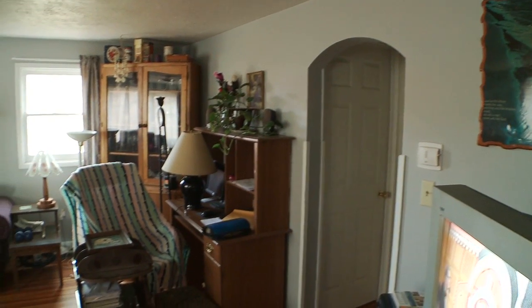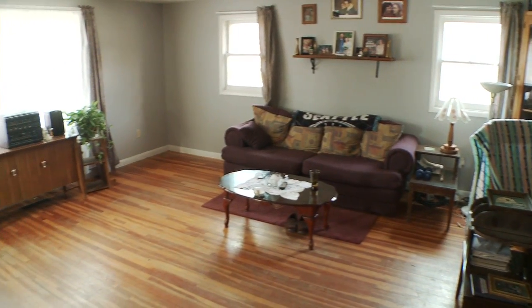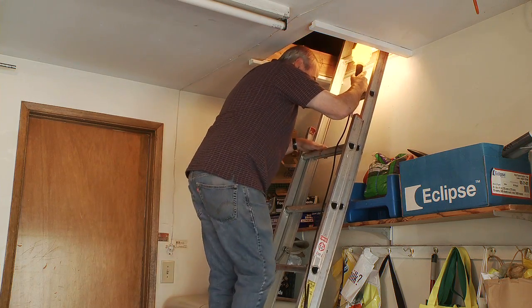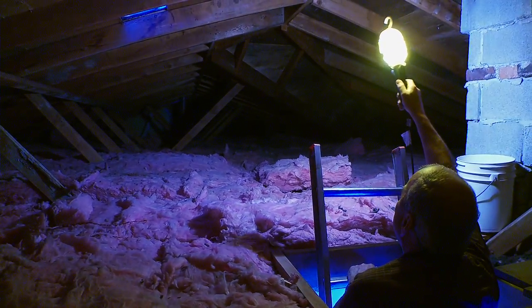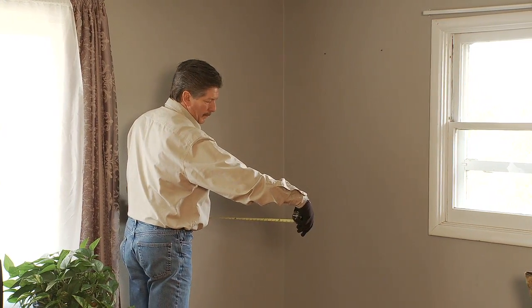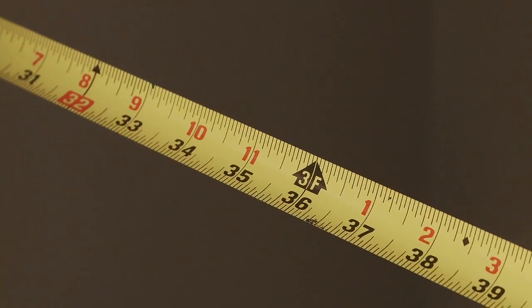When planning where to place your unit in your home, there are a few considerations to remember. First, your stove and stove venting produce and contain extreme temperatures, so carefully evaluate where you place it. Make sure your placement will not involve modifications to roof supports, rafters, or joists, and that there are minimal effects to the draft for the stovepipe. The stove should be placed out of high traffic areas, children's play areas, or near combustible surfaces such as furniture or cabinetry. Minimum distances to combustibles are outlined in the Owner's Manual, so be sure those clearances and protections are met and followed.